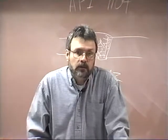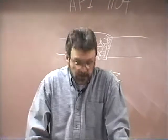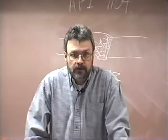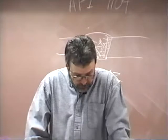So if you have to bevel one in the field, get in there and clean it up to clean white metal before you ever try to fit it. Otherwise, it could cause problems.